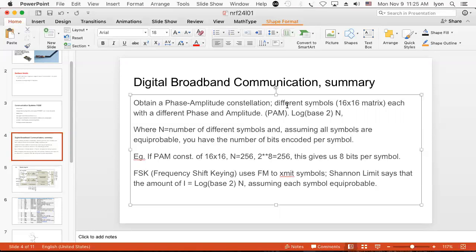So that's frequency shift keying, and you can see this being used even in the audio world. So for example, the Kansas City Standard is good for cassette recorders. Actually, it's a lousy standard. I used to use it. And it runs at 1200 hertz. There's only two frequencies, and 2400 hertz. And that's a bad standard because they are harmonics of one another, and it confuses the decode circuitry when you have bad tape.